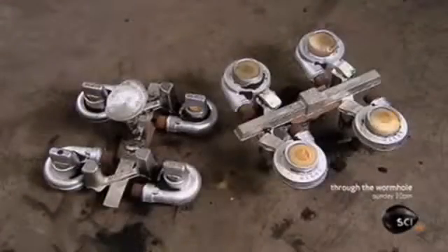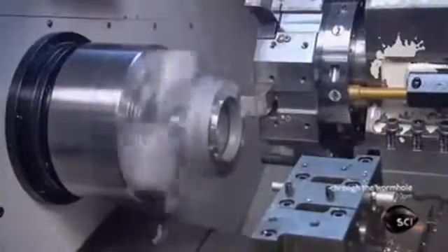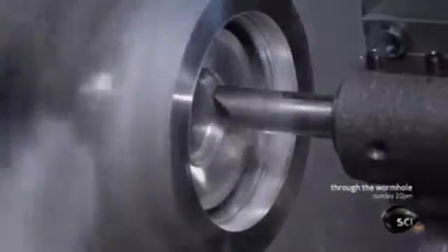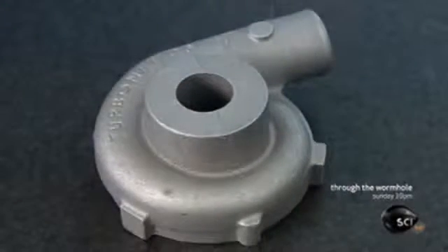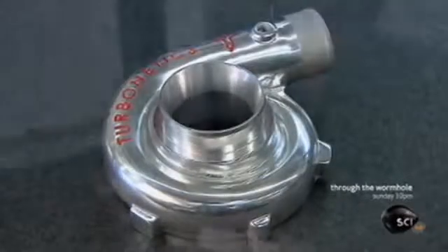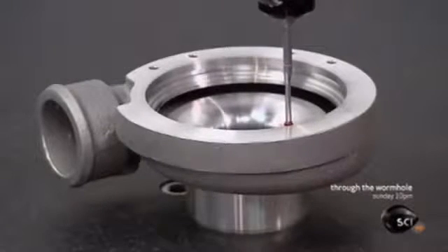The parts are connected by hardened flow lines. After separating the parts, they ship them to the turbocharger factory. Here, computerized tools carve and contour the aluminum part to specifications so precise they're measured in thousandths of an inch. This is the turbocharger housing before the work was done, and after. Using a computerized probe, a technician looks for irregularities — even minuscule ones will need to be fixed.